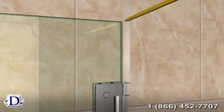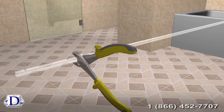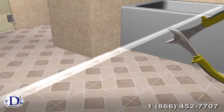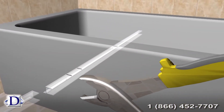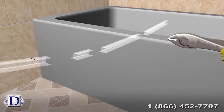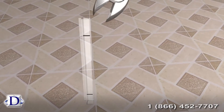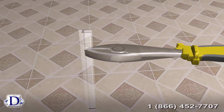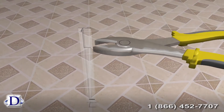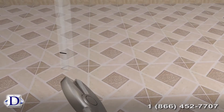Now mark on the seal the top edge of the glass door. Make a full cut to the two central marks on the first group of lines. Do the same for the second group of lines, making a full cut to the two central marks, then cut the top mark. Making the notches: cut the two side lips from the edge of the acrylic to the horizontal marks on both ends of the bottom and middle pieces. For the top piece, do the notch cut only on the bottom end.